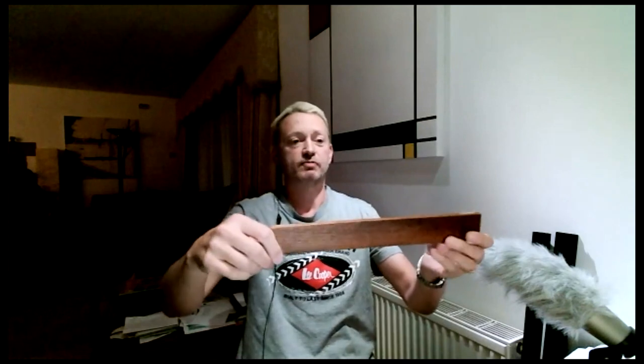What thickness do you prefer? I make the rear one thicker than the front one, and I also make them slightly wedge-shaped so that the base is thicker and heavier — the balance is better. They're about an inch and a half wide. Of course each one could be a different thickness as long as they're parallel. And lengthwise these are down to about 14 inches, which I think is probably plenty big enough for most people doing cabinets and things at home.